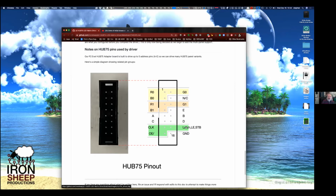So I'm doing everything high speed through just driving the pins directly at this point. We probably, for the simpler panels, will also have an alternate mode. When you tell me it's not the special chip, the driver will probably switch and you just use the streamers, if we can coordinate 6 pins being driven by the streamers.